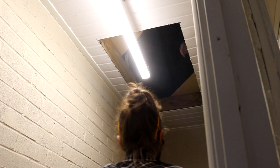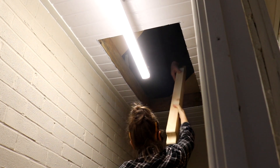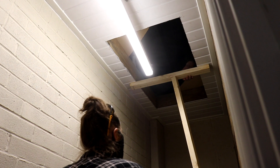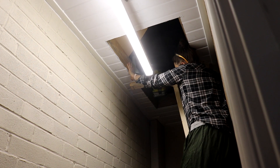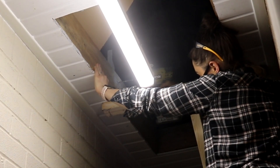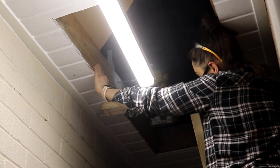The frame was also resting on the fascia itself, which was sagging ever so slightly, so we propped that up with a long length and another off-cut. While my dad was still above, he was wedging in packers between the beams and the frame, directing me where to screw through because I couldn't see where the packers were from my angle — all while making sure I didn't knock the propped-up wood.